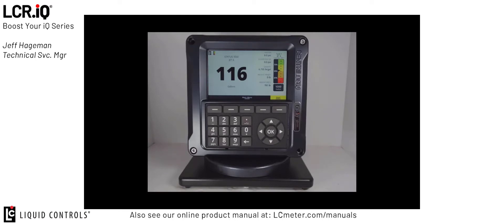In this episode, we will demonstrate both the Liquid Controls XL display as well as an example of a third-party display accepting a calibrated pulsed input. First, we'll take a look at setting up and configuring the Liquid Controls XL LED display. To do this, the first thing we're going to do is place the register in the calibration position so that we can set up the basic parameters for this to happen.